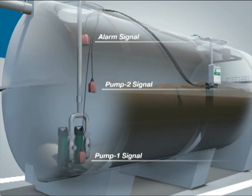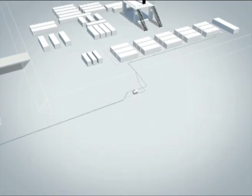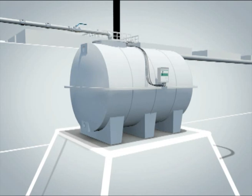The purpose of this large collection tank is to collect the sewage that flows by gravity from the camp and even out peaks that exceed the equalization tank's capacity. Wastewater from communities further away from the main camp can be collected in sumps and pumped to the main MBBR unit through flexible hoses.